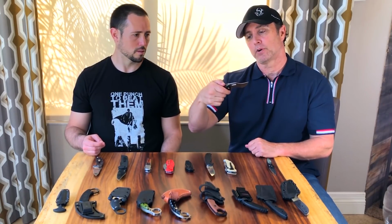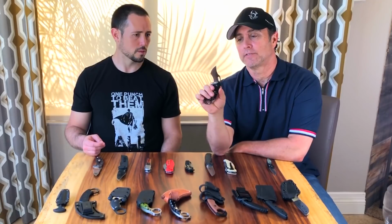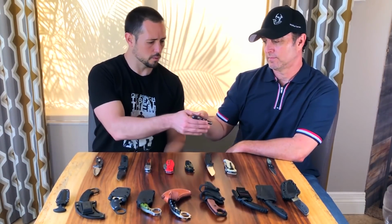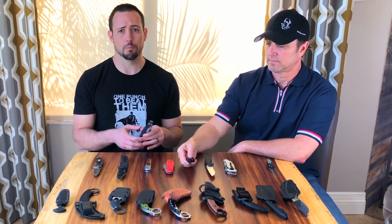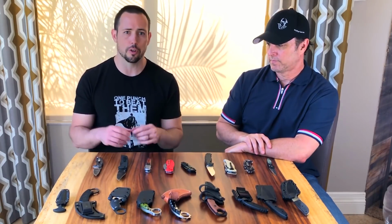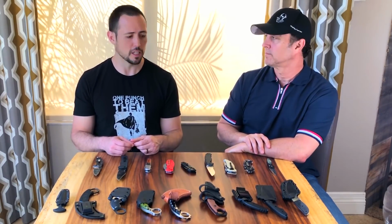And this is a Boker, and it says 0707 and D2, so is that the metal? D2 is the steel. Like I was mentioning before, there's chromium in D2. It's a very hard steel, keeps its edge a long time. For people making professional equipment, including machinists, it's a mainstay. It's used all over the world now, and it's become kind of the standard for non-special, non-patented steels.